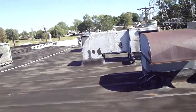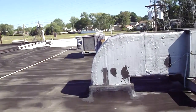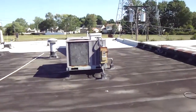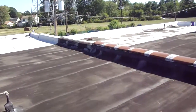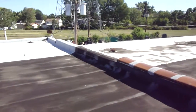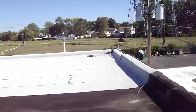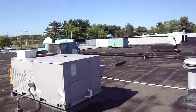Then the only problem with that, Herb, is they're going to have to suffer through a re-roof within 5 years. And that means you're going to have somebody tear this off and keep it tight while they're established inside and they have all their goods in place, and then the forgiveness is 0. You can't have a big leak in the middle of a tear-off. So that's the only downside to that thinking.